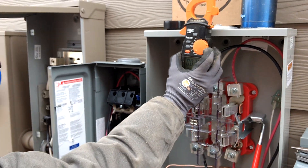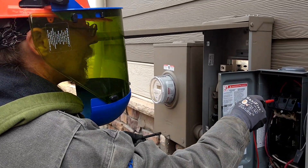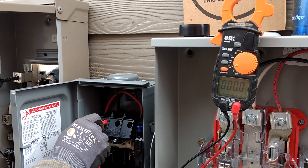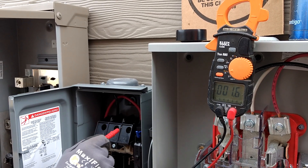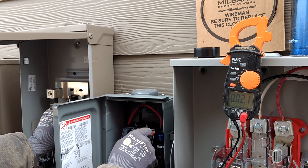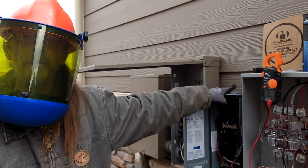Now I check the resistance. If I get over 10 ohms, I tighten my taps a little. Black wire to black wire — that's a good tap. Going red to red — good tap. So now we have utility power to our fuse disconnect.